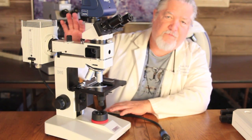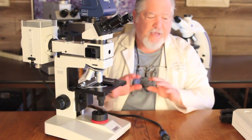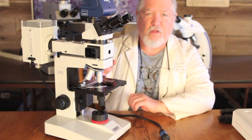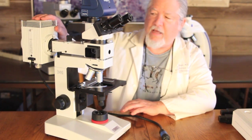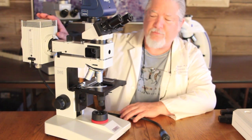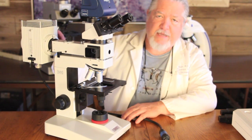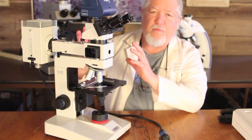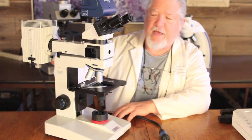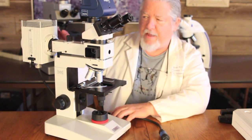Many fluorescent microscopes today are using LED lighting technology. Those are useful to a certain extent, but in a case such as this — as a research microscope where many filter sets are used — you want to have the brightest light source available. In this case we have what we call an HBO 100, a high pressure mercury burner. I would take it out of the lamp house and show it to you, but it's explosive — if you drop it, it can explode. So you want to handle the lamp housing very carefully. When you install the bulb, use gloves so you're not leaving fingerprints on it. When you first turn on the transformer, let it run for at least an hour to get a good burn-in on that bulb. It's a nice bright illuminator.